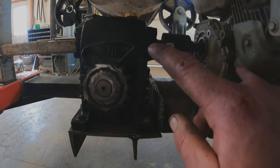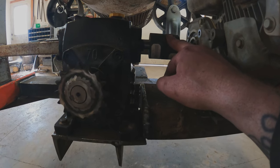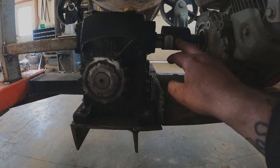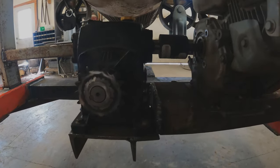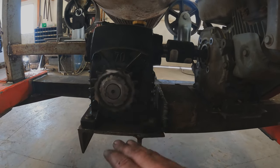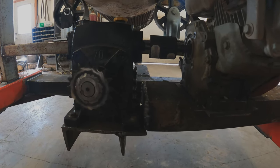Now the finicky part is getting these two to line together. I have a spider gear — these are only rated for about two or three horsepower, so it'll be perfect for this size of trommel. These spider gears do allow for a small amount of misalignment, but if you get them perfect the rubber in them will actually last a long time. You can shim your engine or your radicon up or down — take your time aligning these and you'll have no problems in the future.